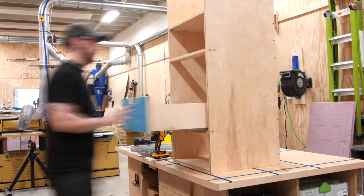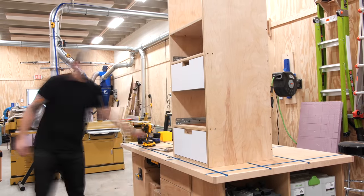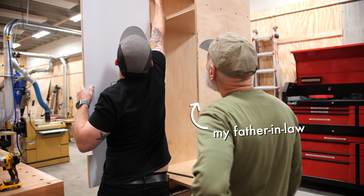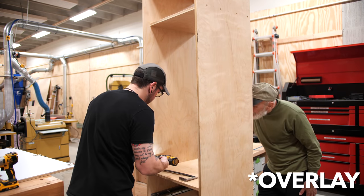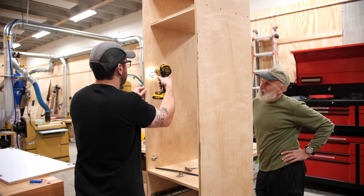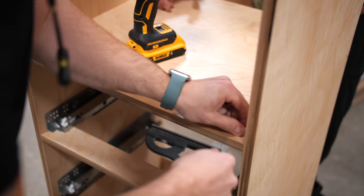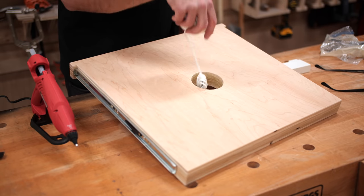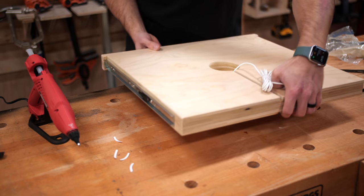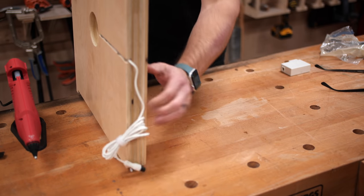Once the finish dried, I could get everything put back together, starting with the closet cabinet. I reinstalled all the drawer slides, got all the drawers installed, and attached all the drawer fronts with a nice even reveal. I installed the closet door using a Rockler jig — it's actually for overlap hinges, so I needed to position it three-quarters of an inch deeper in the cabinet. I added Euro door stops from FastCap to keep the door from swinging too far. The final task was permanently attaching the USB charger using its peel-and-stick adhesive, running the cable through the groove in the underside of the nightstand, and securing it with hot glue.